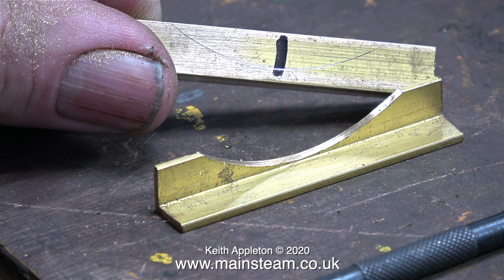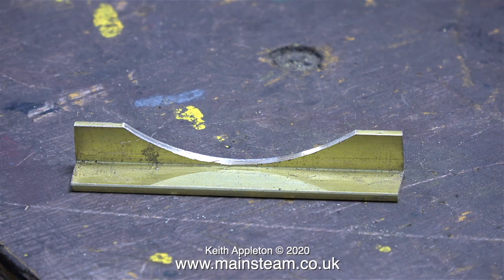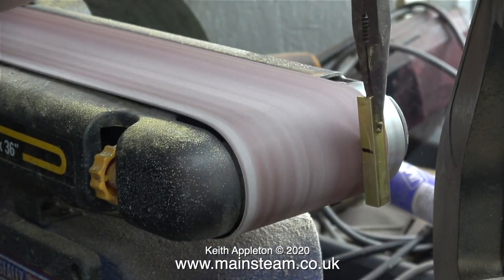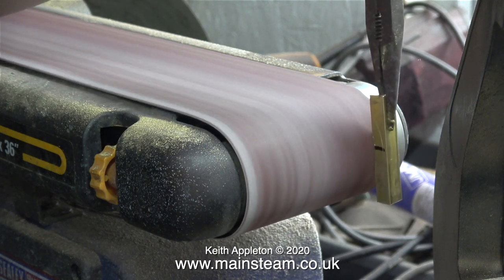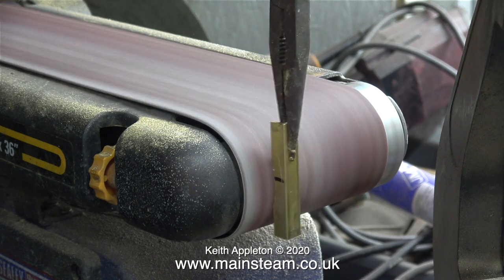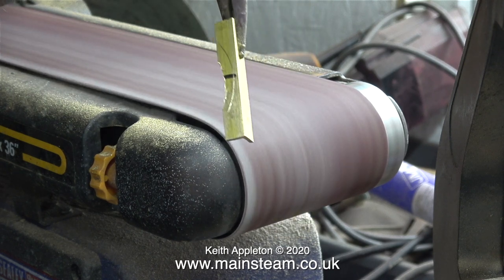How do I do this? Do I set it up on a horizontal milling machine and use a one-and-a-quarter inch diameter cutter, or set up a fly cutter to one-and-a-quarter inches, or maybe just drill lots of small holes around the line and then file it to shape? In the end I found a really simple way: I marked the center, and starting from the center, holding the piece of brass angle in a pair of pliers, I just used the end of my belt sander to grind away the metal I wanted to remove.